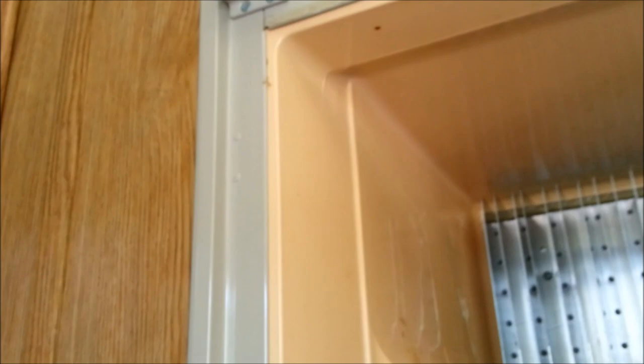The first step inside is to get the doors taken off — we've already got the door off. Since I'm throwing this in the trash, I just lifted and ripped them off. But if you want to take them off nicely to reuse the refrigerator or just replace the cooling coil, loosen the nut on the bottom first and that piece will come off, letting you remove the bottom section of the door. Once the bottom section is off, loosen the nut at the top and the freezer section comes off too. The next step is to take all the moldings off — there are a couple screws here, one there, and a couple at the bottom.